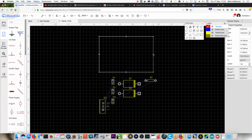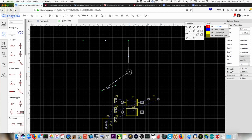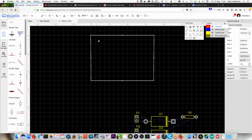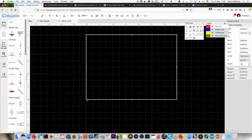When you finish your PCB, you create Gerbers, which are basically information on how the board's going to be constructed. As part of those Gerbers, you've got drill patterns. Where they drill the holes? Where they drill holes, yeah. The routing information, dimensions as well. So if you do an odd dimension, they'll make that odd dimension. They'll charge you more too. No, they don't. Oh, really? No, any weird size you want, they'll do it. They'll just take whatever you give them.